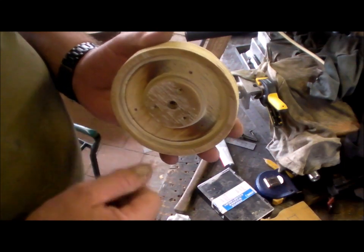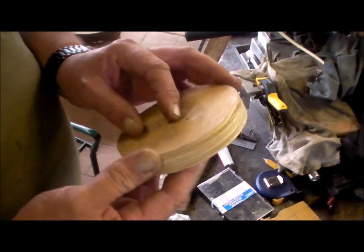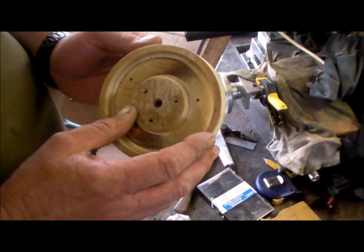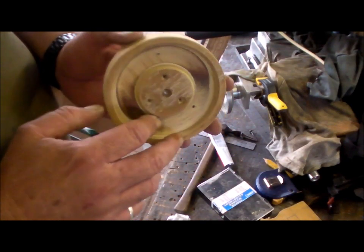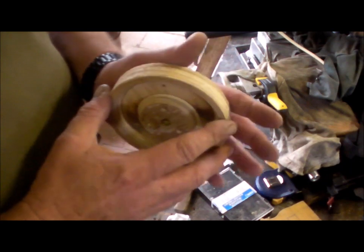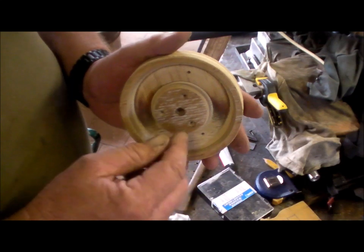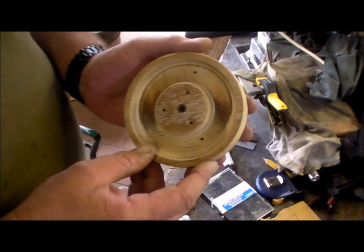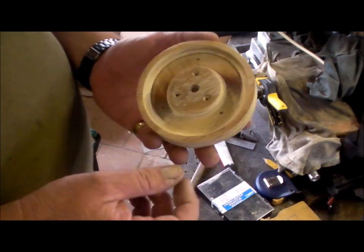I was going to do this on a spindle, which was just a coach bolt, and I've done that before on the quill support, but this time I just decided not to play the game, and there was too much run out in it. So I used the timber faceplate, screwed to that actually, and then screwed this to the timber faceplate and grooved this out. So yes, it begins for the universal compound slide.